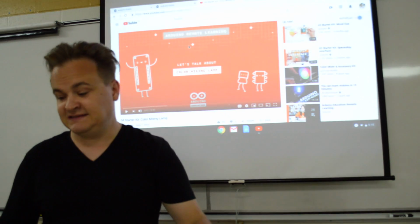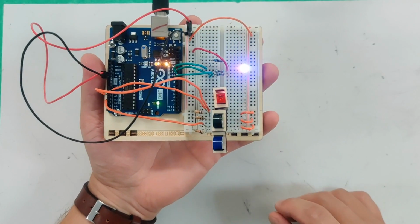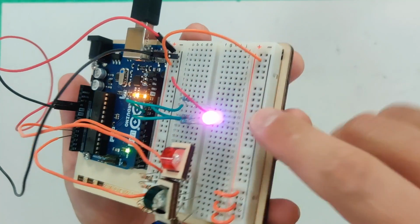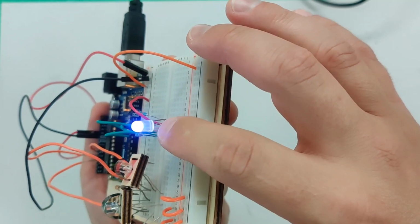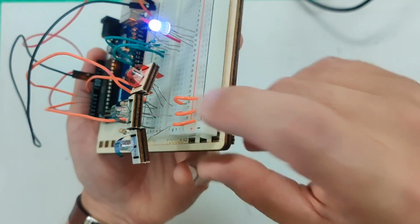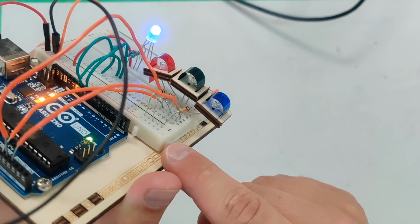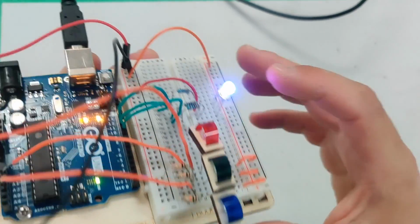Let's talk about the project in a little bit of detail. First, some generalizations about the project. Wiring this thing is very tricky. There's a lot of close things, and your bare wires can't touch each other, especially on this. Those wires might touch up there, and you'll cause short circuits. You can't have any of these wires under there touching. They've all got to be clean. Look how close those wires are to touching each other. You could cause a short circuit or a grounding problem.